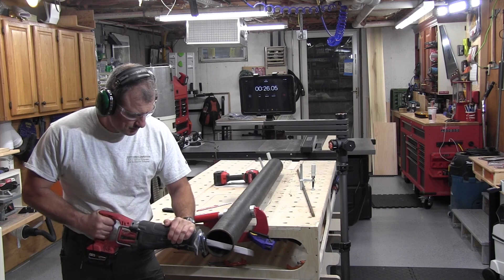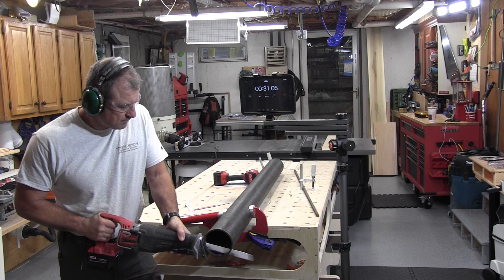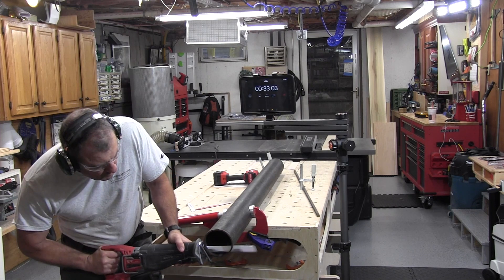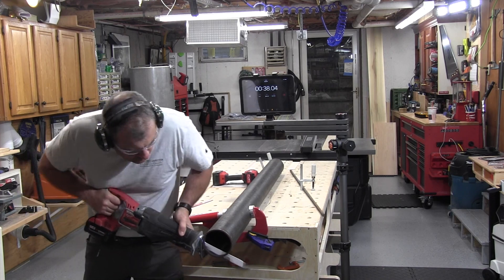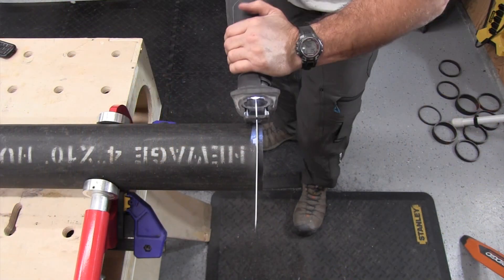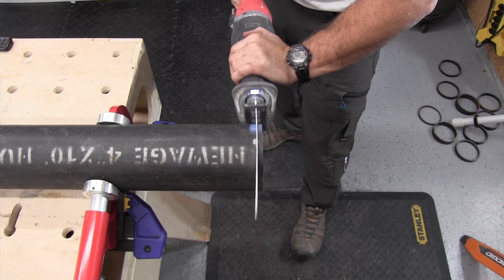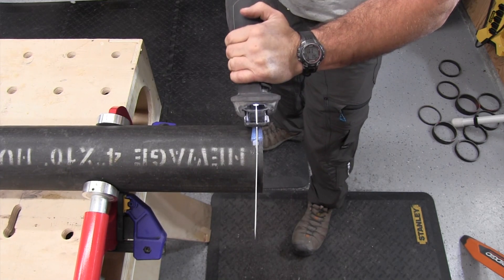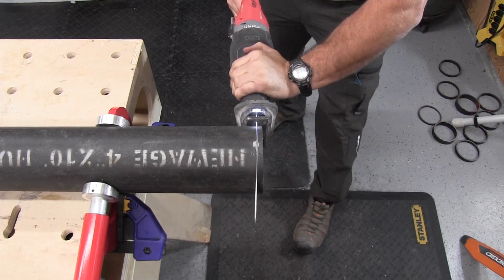This blade has a seven tooth per inch straight tooth set design, which allows for 70% larger gullets between the teeth. The larger gullet space allows for faster chip removal. When cutting aggressively — say, stainless steel — chips tend to gum up inside the gullets, causing saw teeth to shear off or break from the blade's edge. The larger gullet is one key reason this blade cuts faster and more efficiently than a bimetal blade.